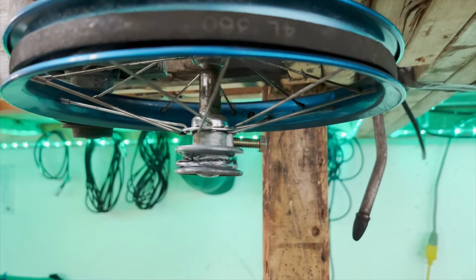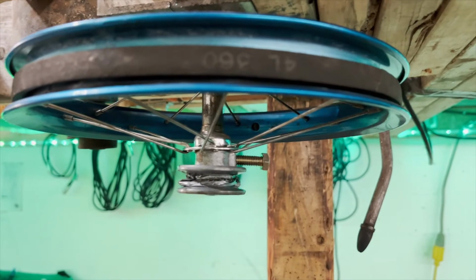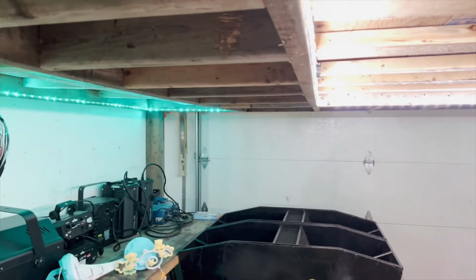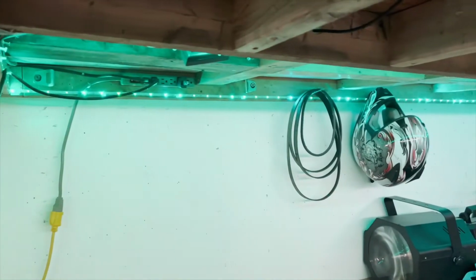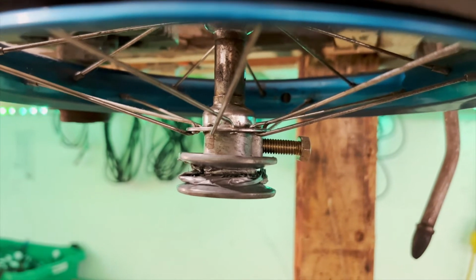Now the main line did have spinners on it. The prototype drive line that we tried did not have spinners on it, and although it worked when it worked and helped give the system enough bite, it probably isn't necessary if your tensioner arm and your main drive pulley have enough tension and enough grip.